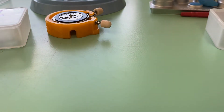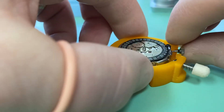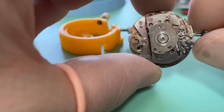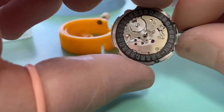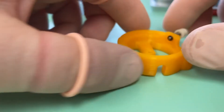Now, these jewels aren't actually commercially available — there is no standard size of jewel you can buy to do this, so they have to be purposely made for this specific situation. A friend of mine in Australia has them manufactured — actually the same man that makes these movement holders. I purchase them from him, fit them in the plates, and we really do get much better timekeeping results and duration of run. We get a higher amplitude, and they are well worth the money. I charge $60 Canadian on top of a full overhaul to do the barrel jewel upgrade, and it's something that only needs to be done once — you never need to do it again. It improves the timekeeping greatly and the overall running.